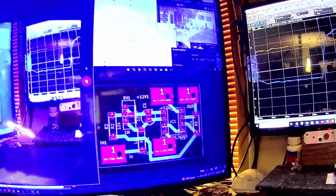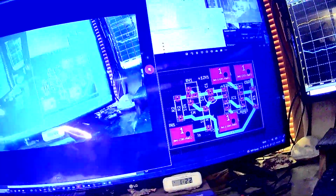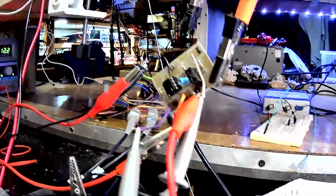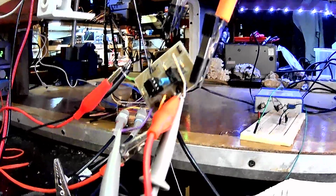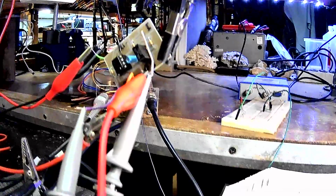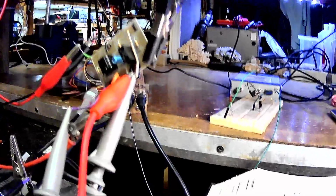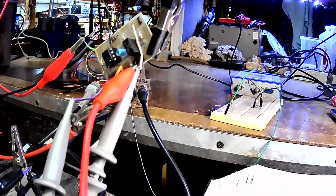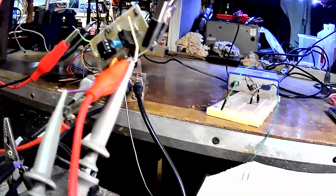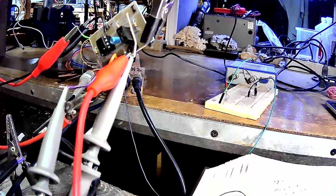So if you want a good averaging integrator, man, this thing will work to outrageous frequencies. I just wouldn't expect an op amp circuit with basically poor specifications to do this. Remember, this is just a dual 741. I'm shocked that it works not just anywhere near 1 megahertz, let alone 25 times that. That just blows me away. I thought an op amp like this would have shut down well before its gain bandwidth product, especially this being an application of it.